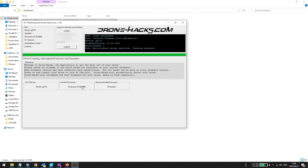This is mainly for guys with the DJI FPV drone, but for those of you with a DJI air unit that are experiencing random goggles restarts, you can go and flash the DJI goggle version — the Vista version. Essentially you get the same firmware version on your air unit onto your DJI FPV side. If you flash the air unit side but don't flash the DJI side, some guys experience blackouts where it randomly cuts out. Upgrading to the latest version in Drone Hacks or any firmware version should resolve that issue. This is just a quick video — if you find it useful please click like, subscribe, and check out the affiliate links below.